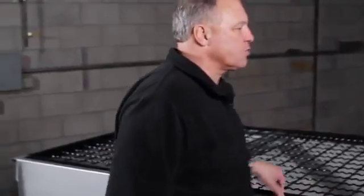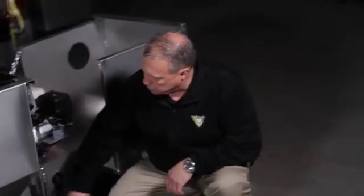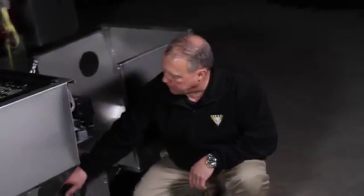All of our hoppers are fully welded on the outside seams, and structural bends are put in to stiffen the body of the hopper itself. On the inside, we have a stitch weld system, and on the bottom of the hopper we weld in what we call chain guides, which actually reduces the torque required for the engine to pull the chain through the sand system. Attached to the hopper are mounting plates used to mount the conveyor system and the motors.